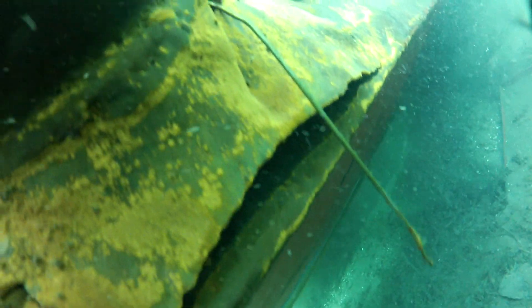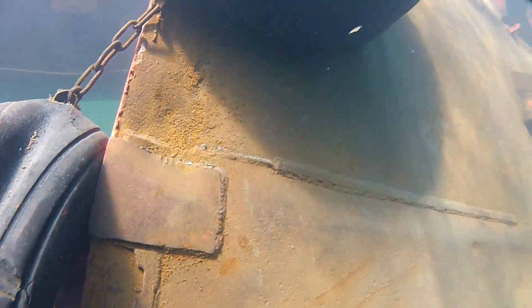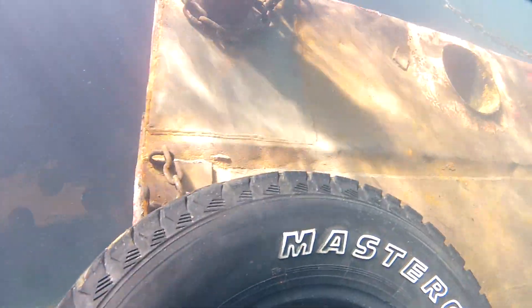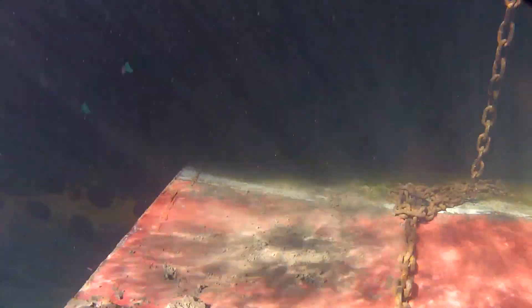This thing here was, I think, cabled off. It looks like it was pulled away from the decking — probably more of a structural design problem. Doesn't look like it's a through-hole design; it looks like it's just surface-welded on, which doesn't leave a lot of strength there. Just checking that seam working its way back up on top. I think we put some air in it already once and had a pretty good hole up there, so we took some grout and packed up the hole temporarily. It's a lot quicker to just glob that on than go down there and weld it.